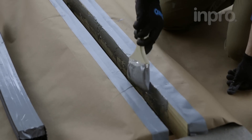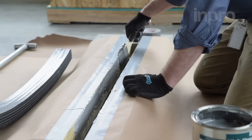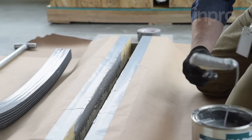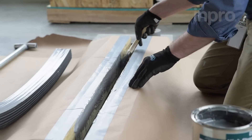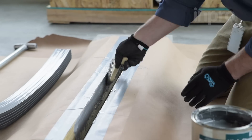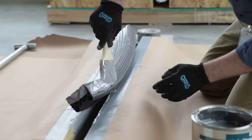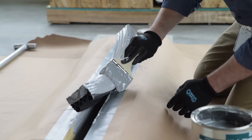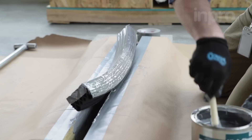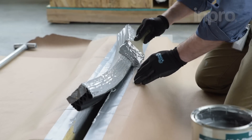You will want to plan an achievable start and stop sequence prior to commencing work. Apply the epoxy liberally to maximize adhesion. It is also important to apply the epoxy within the crevices of the seal, which act as a pooling surface that collects the epoxy while being pressed into the joint. The ribs on the side of the compression seal are patented Joint Master technology. This prevents the squeegee effect, which is common to other seals in the field, where epoxy is wiped off the smooth compression seal surface while being pressed into the joint.